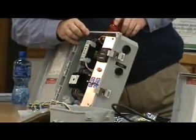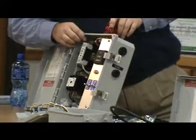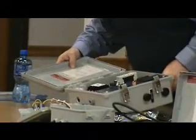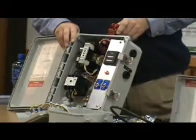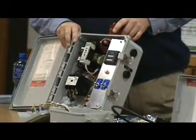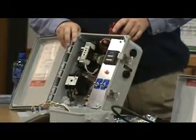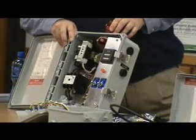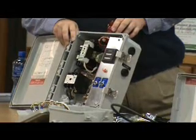What would that fit on? What would this fit on? I believe this one is rated for 20 full load amps. So this contactor on 20 full load amps, you're probably looking at about a 1 horsepower, 115 volt pump. We're probably looking at about 2 horse on a 230. Cost? Cost on something like this, what are we selling these for, Rush? Probably around, I've heard $400, $500.